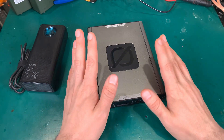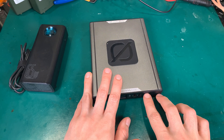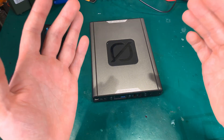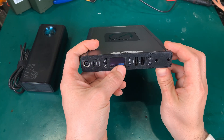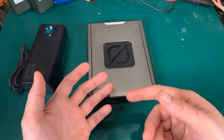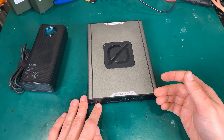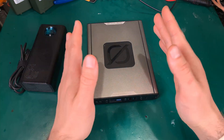All of this makes it a great unit if there is a power outage. I was using it — I plug in a desk lamp, my computer, my phone, all the devices, all electronics. I had tears in my eyes seeing how quickly the battery percentage goes down. Because you've got a power outage, you're working on your computer on battery, then you plug it in and you're recharging the battery in your computer — so you're pulling the max possible current from the USB-C PD port and it's draining really, really quickly.